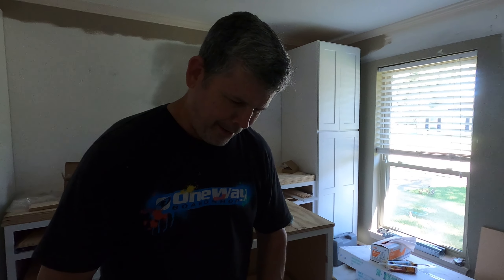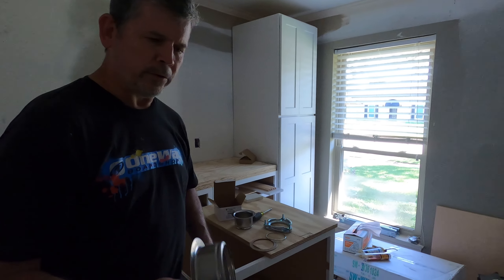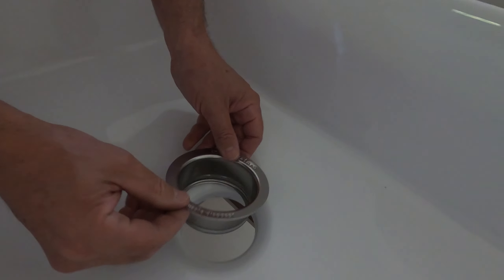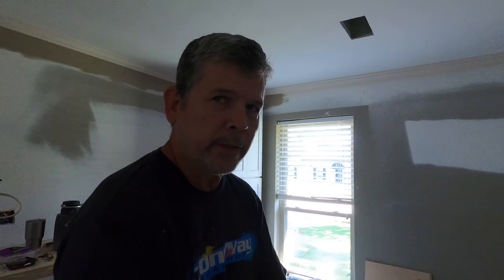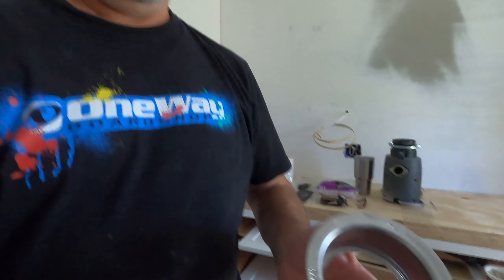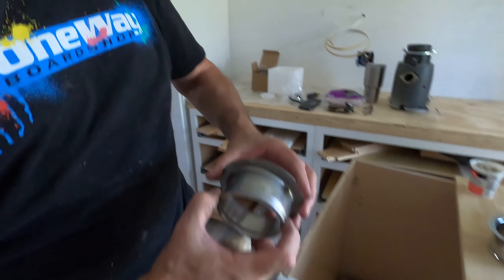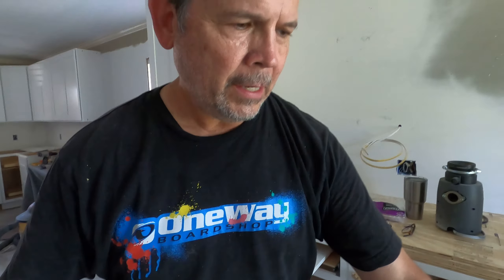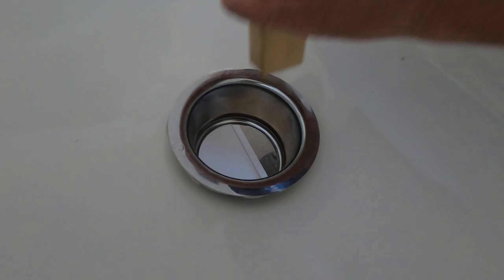But it will not go down — we think it's because of the unevenness of the kiln-fired sink. We're not going to force it. So we took a chance that the InSinkErator brand would fit and give us enough room to put the collars on the bottom. As you can see, it's going in. I'm going to put putty here and use the clamping collar to draw it down so we don't have to take it apart again. But that did not work either — we even put a block on it and tapped it down but could not get the ring on. That's how it goes sometimes.